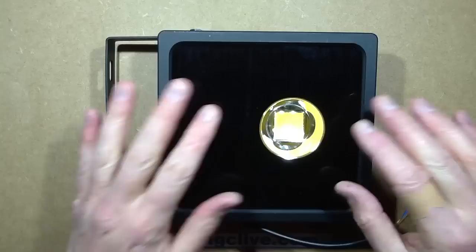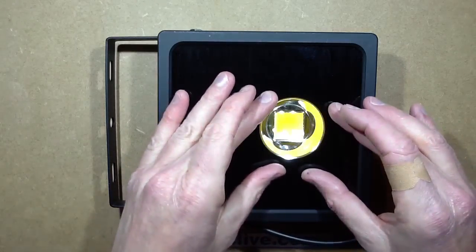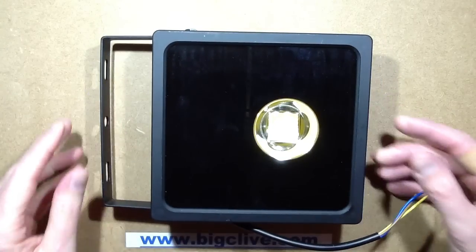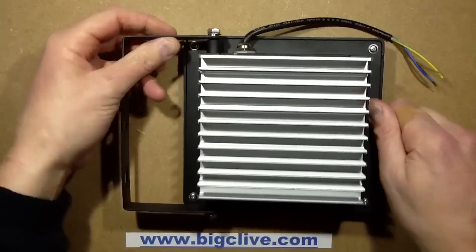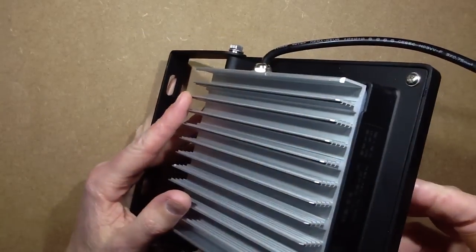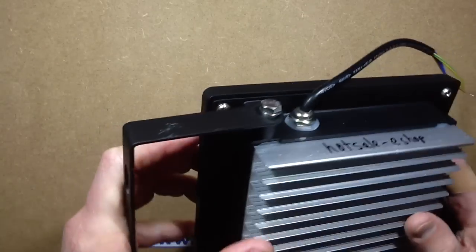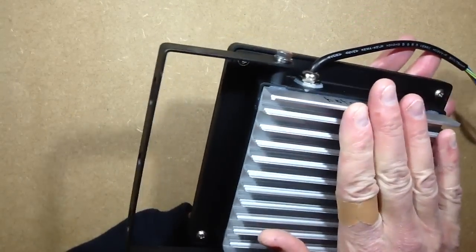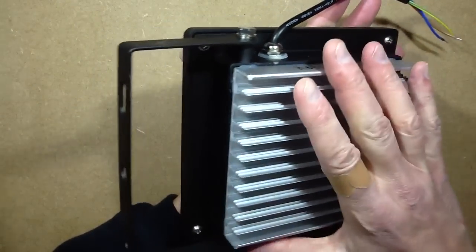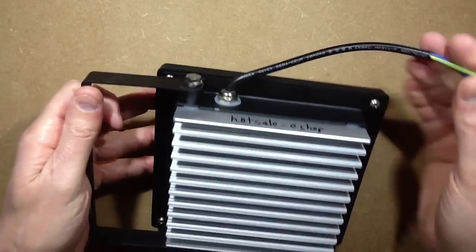This is a novel one — I've not actually seen any others like this. It's a 20-watt LED floodlight but with a much narrower beam angle; they claim a 30-degree beam angle and it seems to have a reflector in it. It's also got the interesting feature that it's got a completely separate aluminium heatsink on the back, pressed into some sort of ceiling gland. I'm not 100% sure why it's a separate piece of aluminium, unless they use higher wattage LEDs with deeper fins and the same case and reflector arrangement. Anyway, let's check the earth continuity.